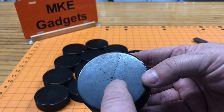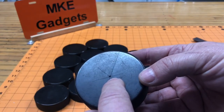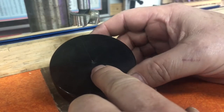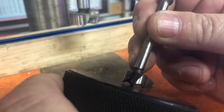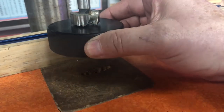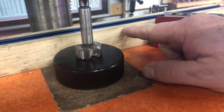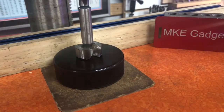My first option is the drill press — let's go over there and make some rubber chips. Here we are at the drill press. I have my punch mark aligned with the Forstner bit; there's a little part that sticks up and I let it fall into that punch hole. I find the punch mark, bring the quill down, and I have a fence in the back to help with location. I'm going in about 300 thousandths — a little less than three-eighths.